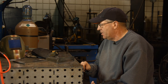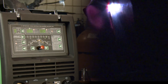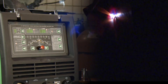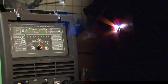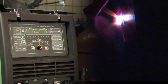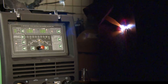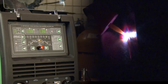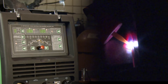Let me get my gear on — I'll be right back. Actually, I think in the intro I said I was at 2 pulses per second; I'm at 1.5. 60% of my amperage at 120, background of 30. I wanted you to see this concept — I don't want you to get lost in numbers, I just want you to see that it is a pulsing weld. And I'm leaving the wire right on the leading edge.